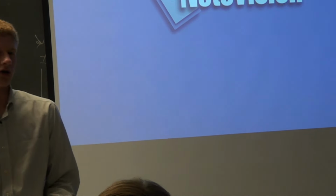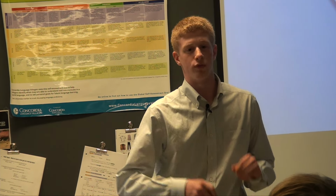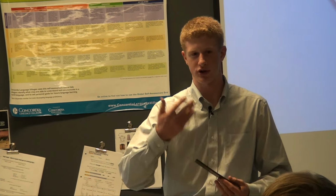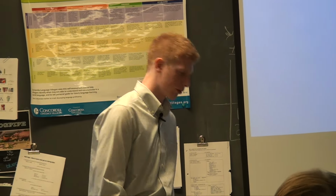Especially on this piece right here. If I were to take a grinder and go over it, because it's a very thin layer of this that actually gives you that color, I could probably rub it off with my hand. So it gets rid of the color. Does it get rid of the property? It does not get rid of the property. In order to do that, you would have to reheat it and bring its temperature down slowly so the crystals realign. You'd have to anneal it, in other words.